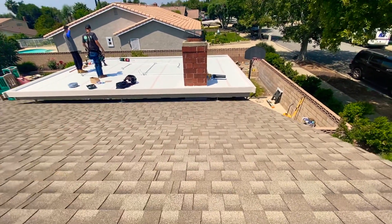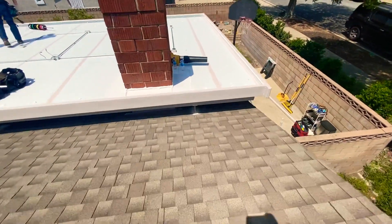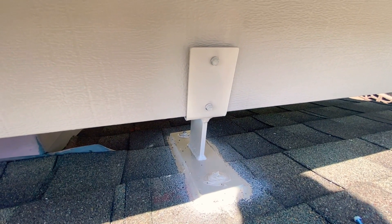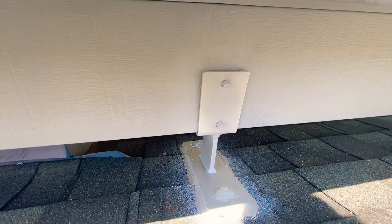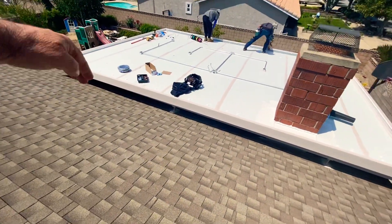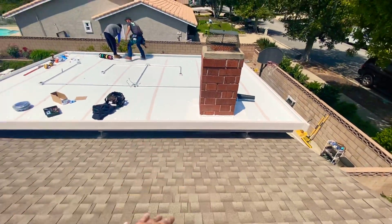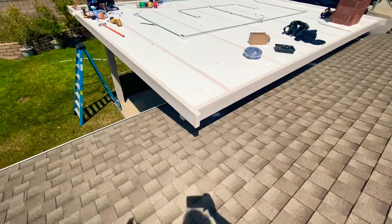If you're flowing underneath that — let me see if I can zoom in — this is a roof mount beam lift bracket on top of the roof. If we seal around that, we paint the screws. The guys painted all the brackets so it can match a little bit there. And the water will go underneath that patio cover here. As the water goes underneath that patio cover, we welcome it. We don't want to put flashing and stop it because where's the water going to go? We want the water to continue underneath the patio cover, and there's a rain gutter here to catch it.